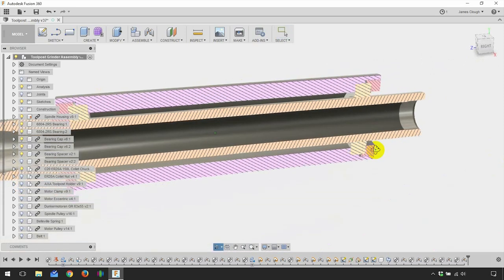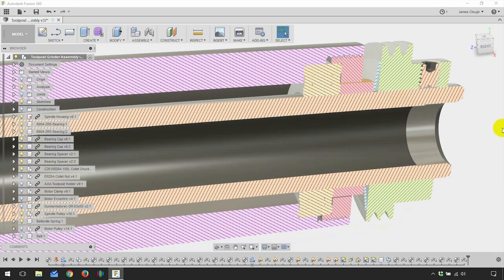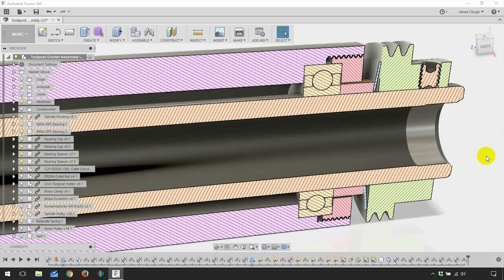On the back side of the spindle we have exactly the same thing — another bearing and another cap. That leaves the spindle free to slide in and out, so to lock it, there's ultimately a pulley on the back and another spacer. I want to preload the bearings without doing it rigidly, because if the temperature of the inside of the spindle changes, materials expand and contract — it'd be very difficult to control preload rigidly. So I'm going to use a Belleville spring, a cupped washer providing about 15 pounds of force. I can adjust it by compressing the motor pulley in, which compresses the Belleville washer putting force on the inside bearing race, which then locates the spindle accurately.